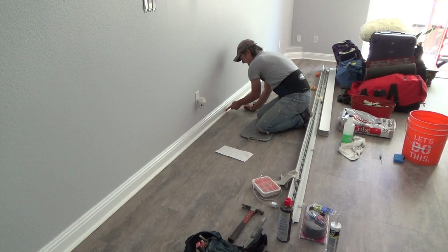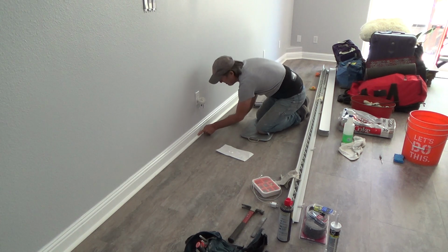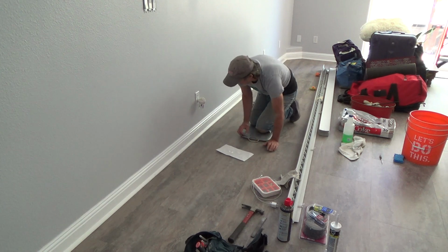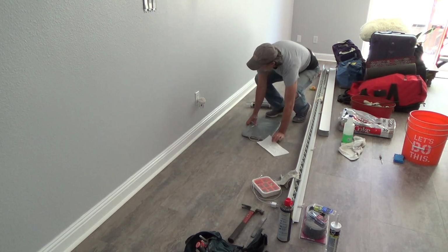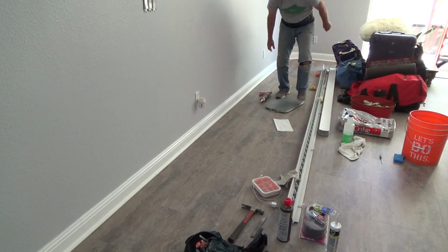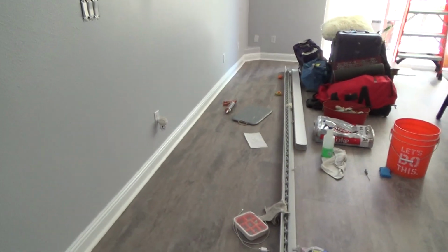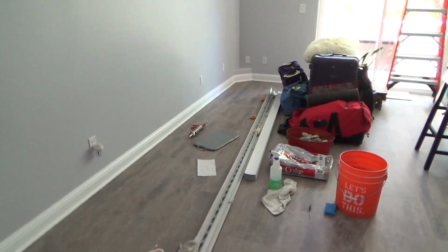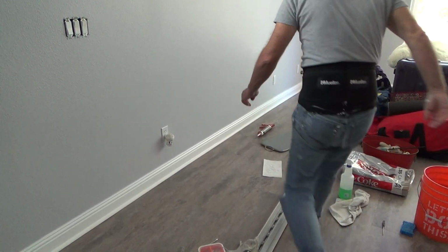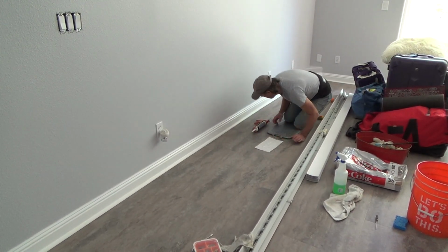Okay? I don't want to pinch my finger down in there and press out all of it, because I want a nice layer on there, right? I want it even, and I don't want it to spooge out too far on the base or on the quarter round. Okay, so I'll keep going here this way. And that's working with a little paper towel, sliding that along.